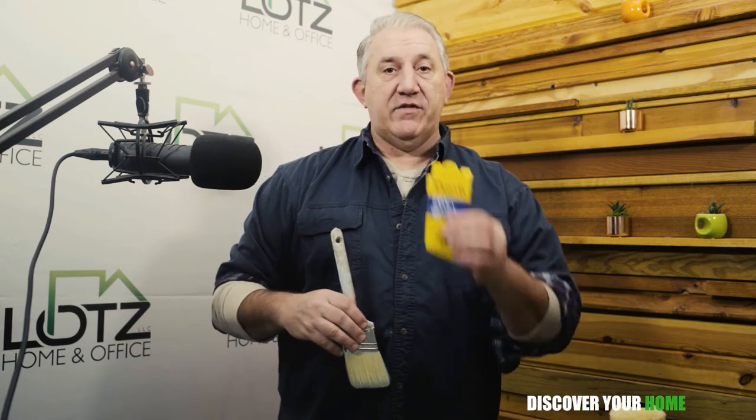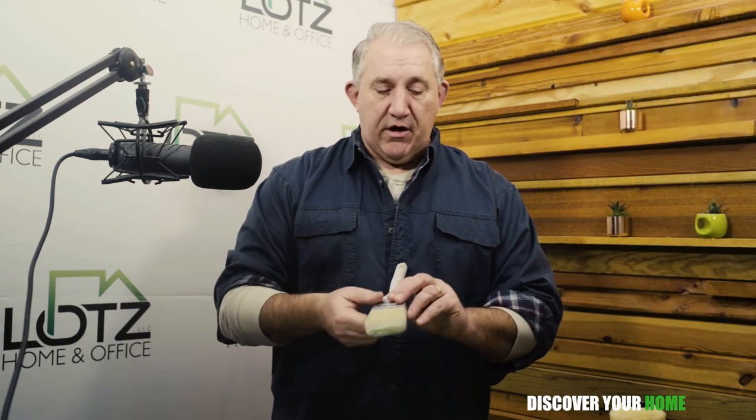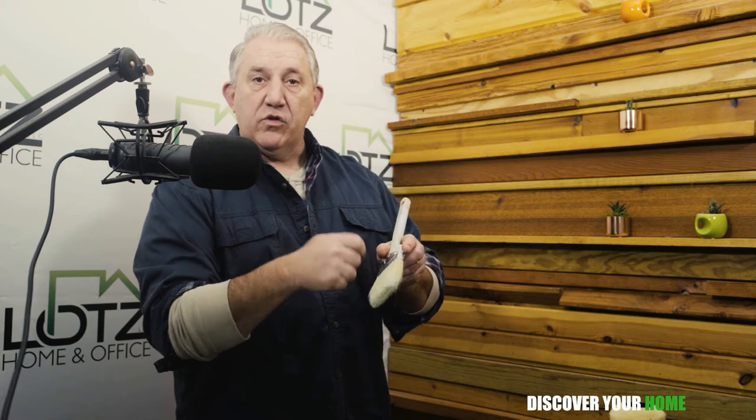This is a polyester brush; this was actually a China bristle brush, which keeps the material softer. Put it in there and rinse it out. Then you want to put it back in its case to keep it formed. Before you do that, make sure you kind of dry it out and either re-form it or use a brush comb — they sell them at paint stores and hardware stores. It's a metal comb to brush it out. If you find dried-up paint on the upper bristles, you might want to take a plastic or wire brush and just loosen that up.